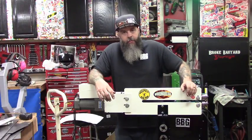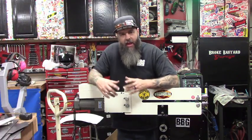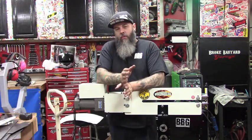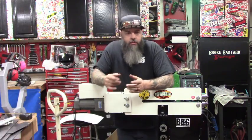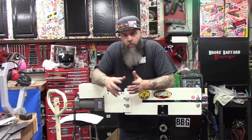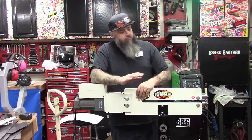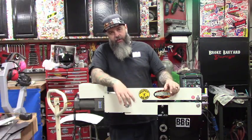That's about it for the Super Bead. I got to say I'm impressed. This body here is about half-inch steel. The previous one had issues — when I really put pressure down on the dies, it would flex as I was turning. You guys saw me take one-inch square tubing, weld it in, and reinforce it to keep it from flexing. This one? No flex. I ran different material through it — nothing. It's good to go.